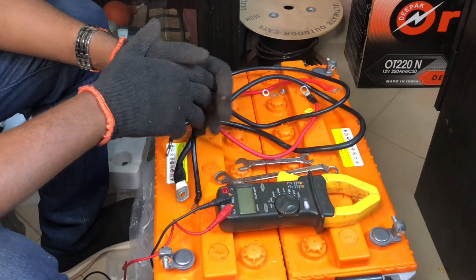That was the simulation. We are now going back to the laboratory to carry out a practical example physically with live batteries to see if we also get the expected result. In the simulation we used four batteries and got 48 volts; in the laboratory we will use two batteries, so we expect 12 plus 12 equals 24 volts.